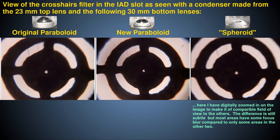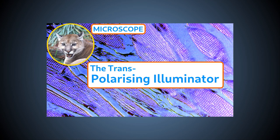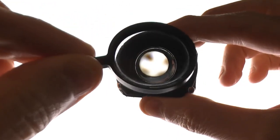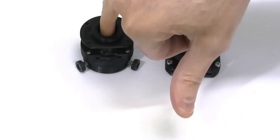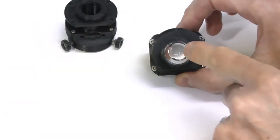Note that because these lenses are not perfect, you will not see everything in perfect focus from the center to the extreme periphery. That's okay, as long as at least part of the field of view is in good focus. Recall from the tutorial on the polarizing condenser that the reason I designed a separate module for polarization is that the molded glass lenses used for the Abbe condenser are anisotropic, so they don't allow good extinction of the polarized light. The polarizing condenser is a bit of a misnomer, because it doesn't actually contain any condensing lenses, so only gives low numerical aperture illumination.